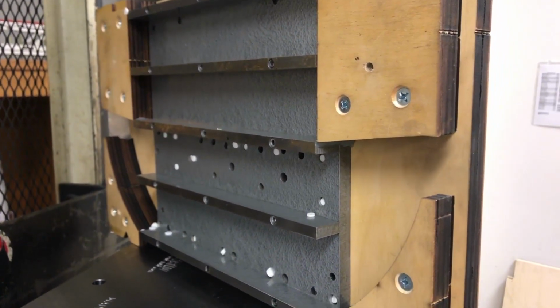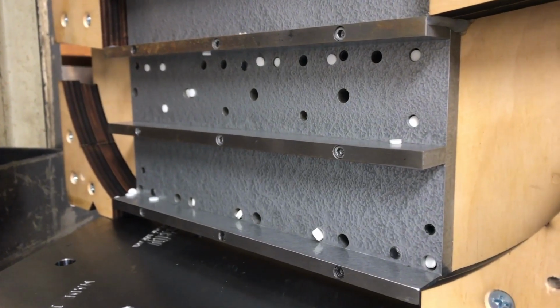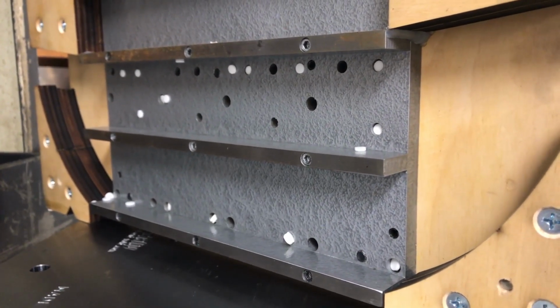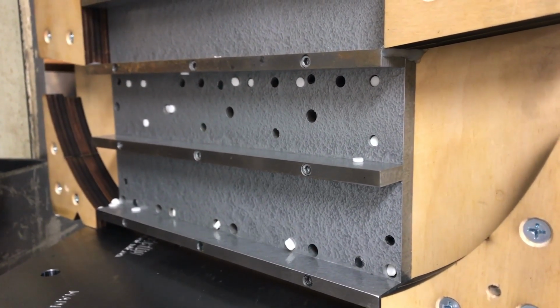As you move around back, you'll see the parallels and basically the cavity where the parts are ejected through. And you have a few options as the slugs come out the back. Most people will either put a positive air pressure system on it, where you're just simply blowing them out of the die while you're cutting, or they'll put vacuum and collect them that way. Either one is fine. You can even use a combination of the two, where you have positive pressure coming in from one side and vacuum drawing out the other.